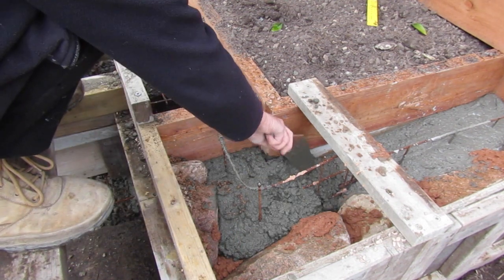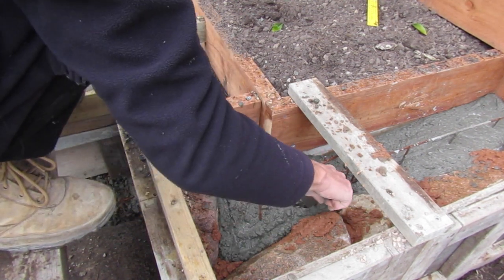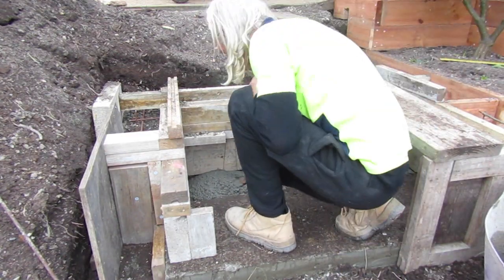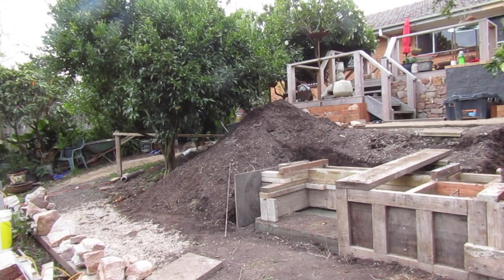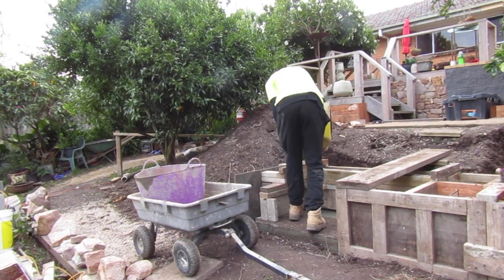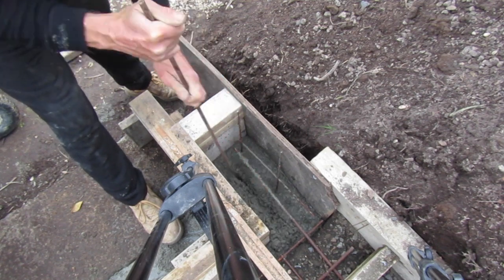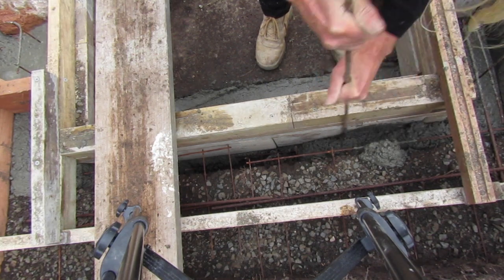It's important to agitate this concrete around all our reinforcement bar and onto the back of our stones to get a really good adhesion. Pouring the concrete for this whole bottom step and wall configuration all together was kind of complicated, but it gives us extra strength having this whole system poured in one concrete pour. The concrete form I'm filling here is actually a foundation for the hollow block wall that runs up the side of the staircase. I wanted to incorporate these three elements all with the one foundation. By tying them all together, it's going to make a really strong retaining system.